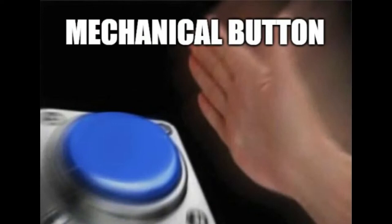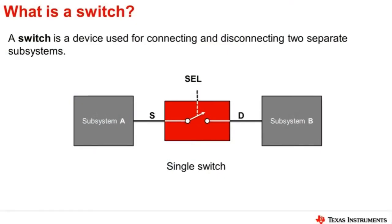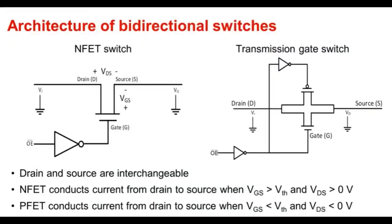You can use a relay, but relays are really, really big and they're loud and clicky and they do fail after a while because they eventually oxidize. An analog switch is kind of like a mysterious and mystical thing. It acts just like your everyday normal mechanical switch, except that the thing that connects or disconnects is a digital signal. In this case, they are implemented by having two back-to-back NFET and PFETs. By manufacturing this on your silicon and doing a good job with the isolation and the specifications, you can have it be a bidirectional switch, so signal can go back and forth between the two sides.